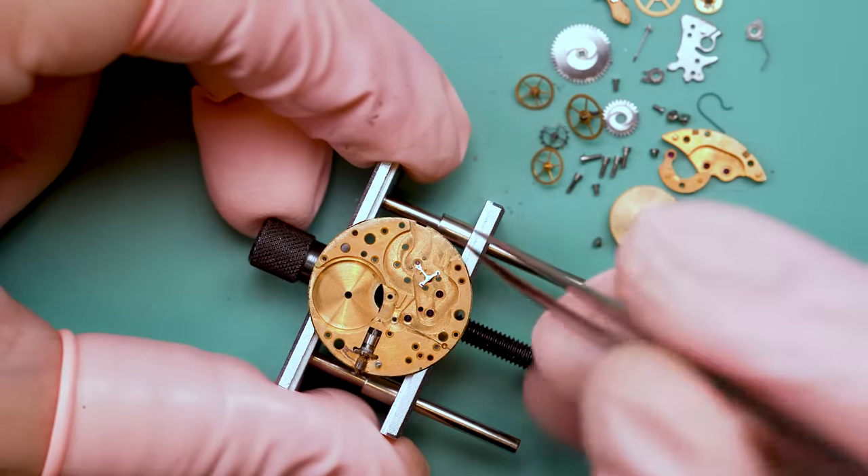Just a quick reminder of the scale that we're working with — those are the screws. I do all this close-up work with the microscope and macro lens, but I do like to remind you every once in a while that these are very small. And this movement is quite small too — even by modern standards it's small. It looks like we can take a trial run at getting this watch back together and starting the reassembly process. I think it looks fine, and I did about the most thorough cleaning job you can do on this thing — it went through ultrasonic, the watch cleaning machine, detarnishing, and re-ultrasonic.